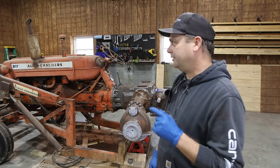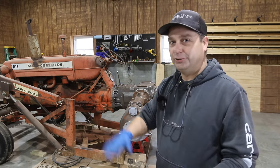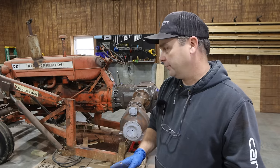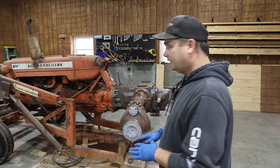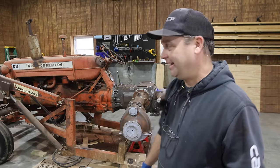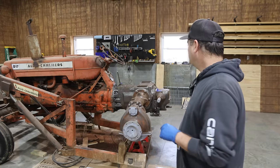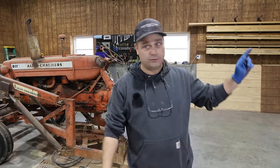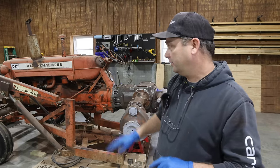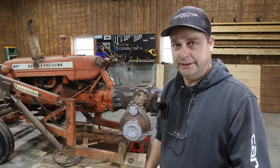The next thing I need to do is get the workshop ready for painting. I don't want to get overspray all over all my stuff in here. I've got some canvas drop cloths - I think four of them - and I'm going to lay them out on the concrete floor to cover as much as I can. Then I bought some plastic sheeting, and I'll tape some up over the walls and the garage door, and cover up the parts of the tractor that we don't want to paint.